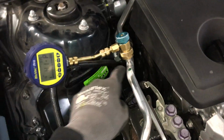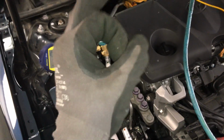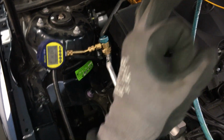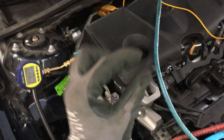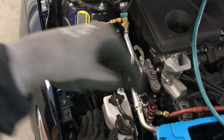So now I'm depressing the valve. Now this valve core, this is another thing HVAC guys don't know. The size of the valve core head inside here is about the size of a number 2 red pencil eraser, that diameter. When it's a big piston, it's like a valve in a 454 Hemi. It's a big valve that gets pushed down. It's not a little tiny Schrader core that's in residential or commercial HVAC. In automotive, it's a huge valve, so there's a big surface area.